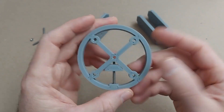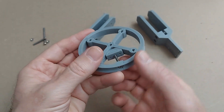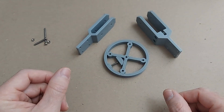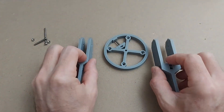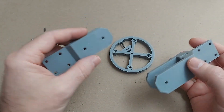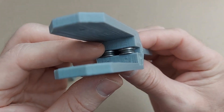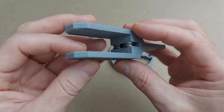The cable goes through the trolley with a crimp on the end to stop it from going back through. The same thing with the other cable — it goes over, through the channel, through the channel, through the trolley. When you tighten this bolt you pull tension on the cables — it's a nice little trick. You print these forks with the layer going this way. The smaller one is pretty simple; the larger one is more complicated and has a place to put two steel pulleys inside to guide the cable, using a bolt for each to lock them in place.